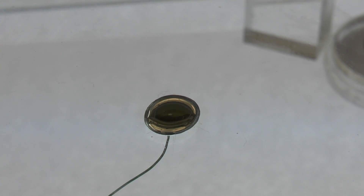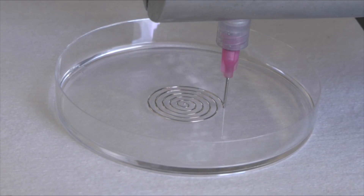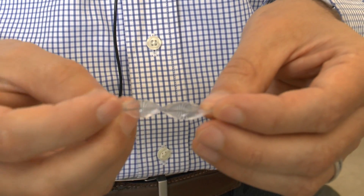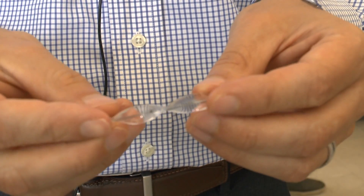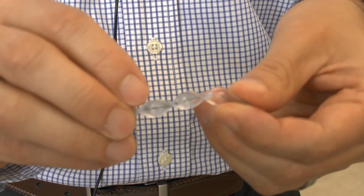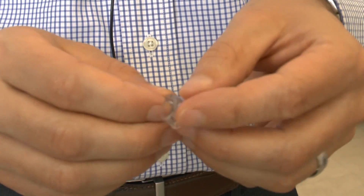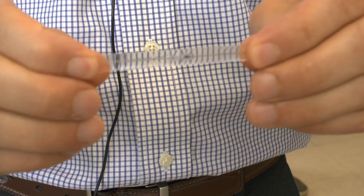When I saw that as an antenna engineer, I immediately thought, well if we can harness this, there's a lot we can do. The very first thing we did was simply inject the metal using a syringe — it's really extremely simple. The end result is you get wires and also antennas or any sort of metallic structures that have mechanical properties defined by the encasing material. So if you were to inject it into a rubber band-like material, you would end up with a rubber band conductor.